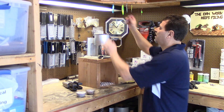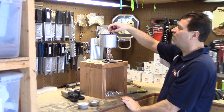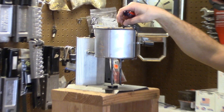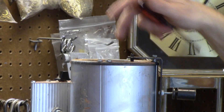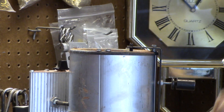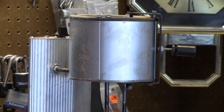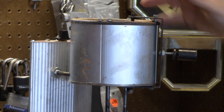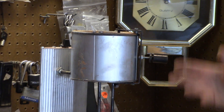I use my screwdriver here - this is something that a lot of guys don't know about. The screw on top can control the flow. When I'm doing smaller jigs I don't want my pot to be full, so I can control that just by twisting it and it'll shut off the flow, make it a lot slower. When I've got it up at the top, if I'm doing larger jigs - one inch or larger - I keep that all the way open.